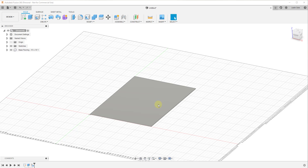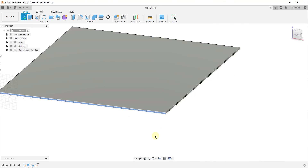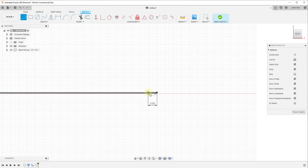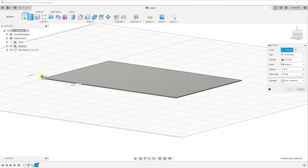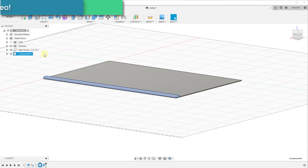We're going to schedule these things out a little bit later. I'm going to start off by extruding out wood boards for the different parts and pieces. For this one I'm going to create a sketch aligned with this face, and I'm going to assume the base pieces are going to be two by sixes — that means five and a half inches wide by an inch and a half thick. I'll model out the profile of this board, finish my sketch, then extrude it — setting the extent to distance, making sure this is set as a component — negative 15 feet long. I'm going to click OK and name this 'two by six, 15 feet long.'